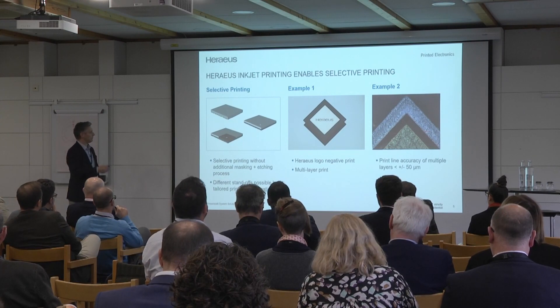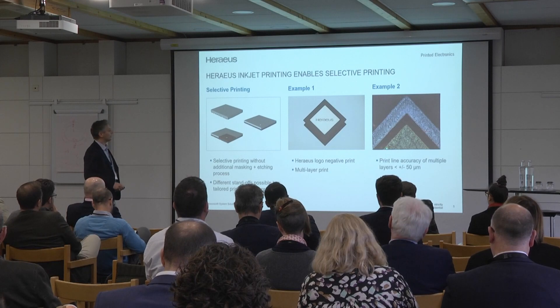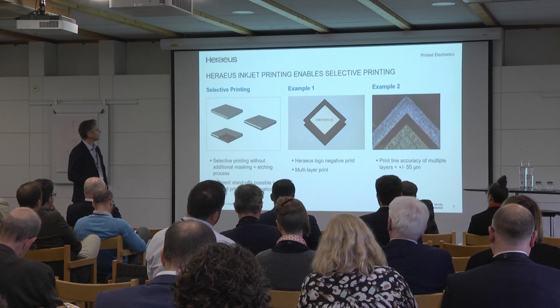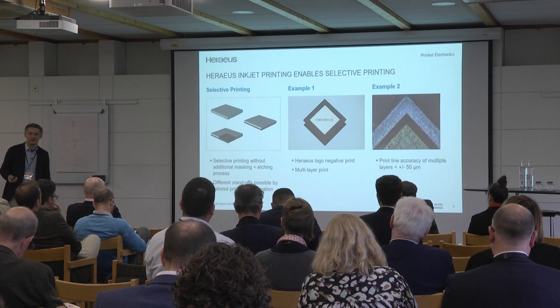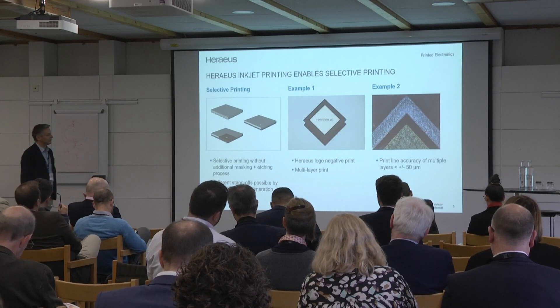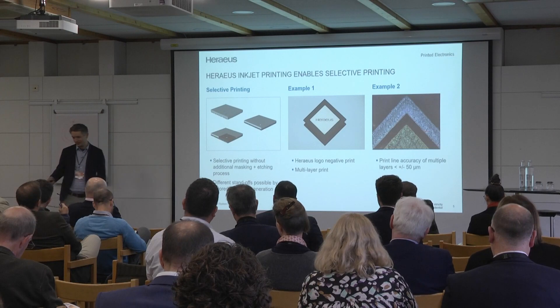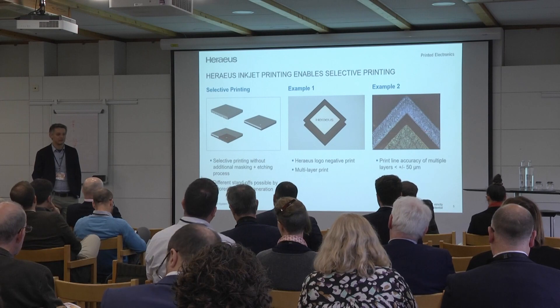The other capability is printing shapes on the top side — that's nothing special for inkjet. But the very important thing for the semiconductor industry is accuracy, repeatability and reliability. We're talking about tolerances of plus or minus 50 microns that we need to reach on top sides of SIPs and on the side walls. Everything needs to fit together — the ink is tailored for the print head, the print head has to be reliable, and any kind of deflection over time is not accepted.